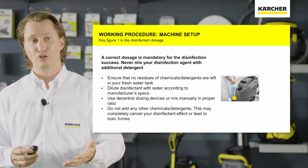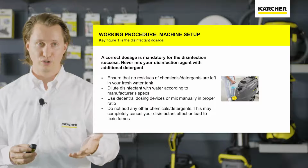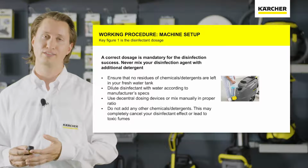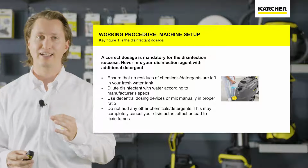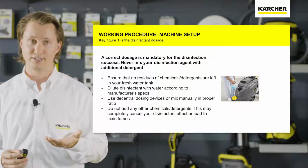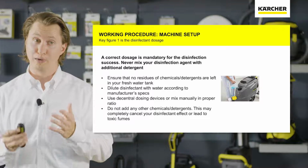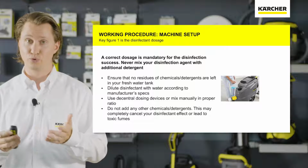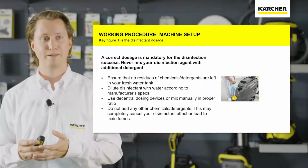So as mentioned, make sure to have a neutral floor before starting with the disinfection. Dilute the disinfectant with water according to the manufacturer's specs. A very precise dosage is mandatory to achieve a proper disinfection. Too much or not enough of the disinfectant can ruin the whole job.